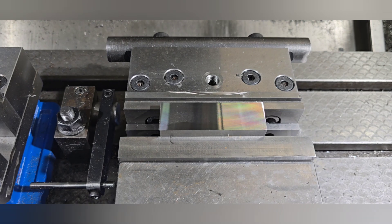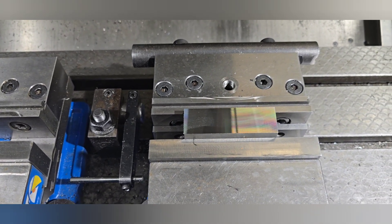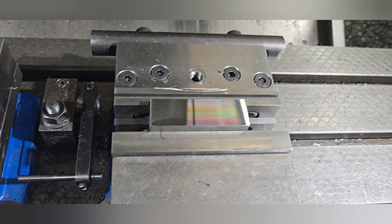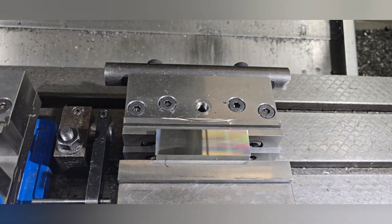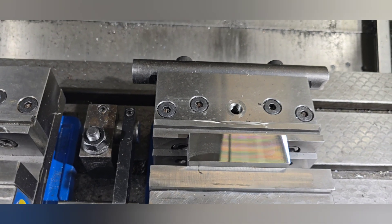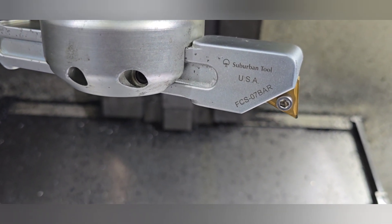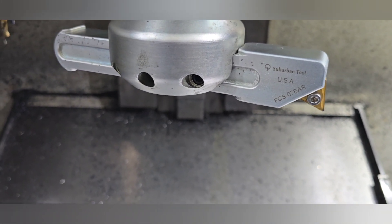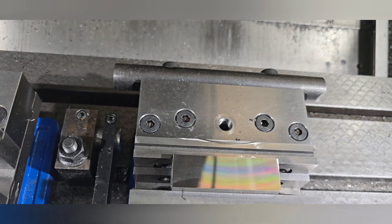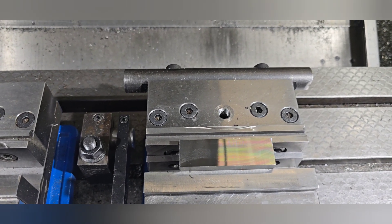We sell these cutters on eBay — this is not a sales video, more for information — and they're also available from subtool.com; links will be below. It can save you a lot of money, especially if you're a company. When you're taking light cuts on hot rolled steel to remove the mill scale, a five-insert cutter just tears them up, whereas this cutter gets under the scale and flips it out of the way. The reason you don't need coolant is that the heat comes off with the chip, so this part won't even get warm due to the cutter geometry. Thanks for watching.